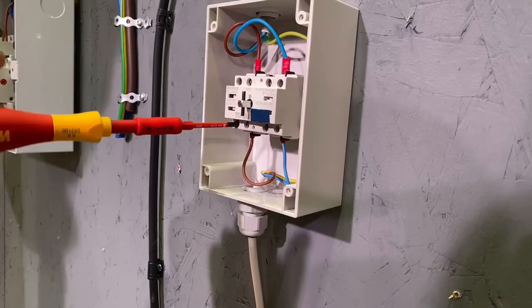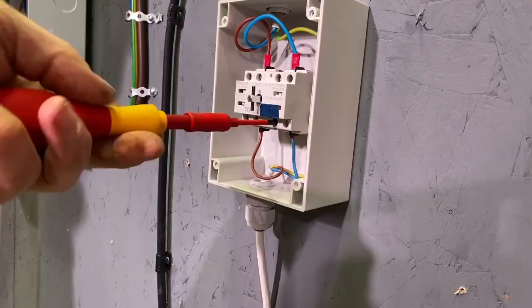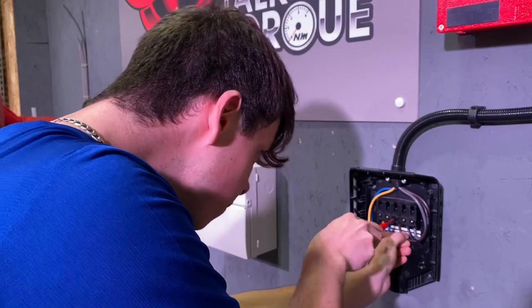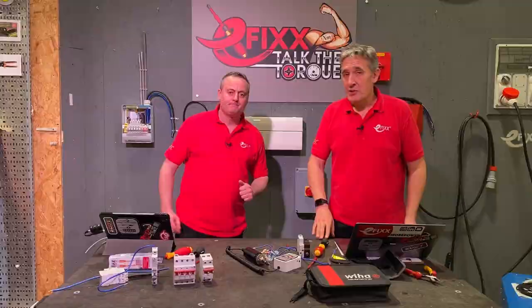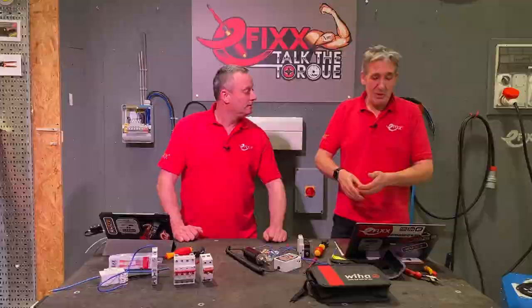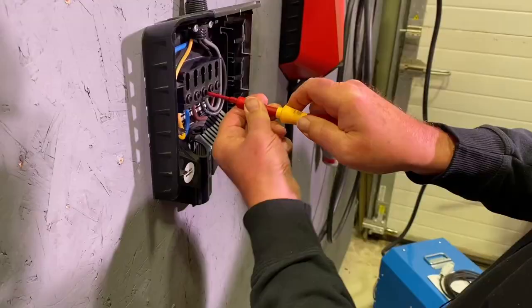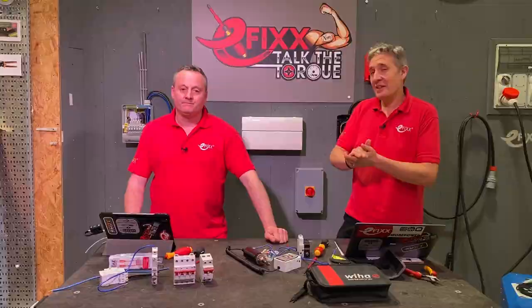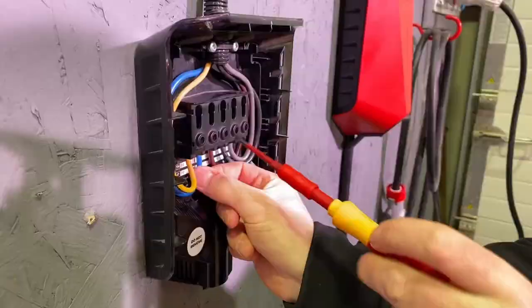For the EV charger, there was a lot of squeaking plastic and nervous tightening as contestants had to reach 5 Newton meters. Only one contestant managed to get within range, achieving 4.7 Newton meters — within the plus-or-minus six percent band you'd expect from a torque screwdriver. The lowest was just 1.06 Newton meters, and out of 11 contestants tightening all connections, only one connection total was made to the required torque setting.